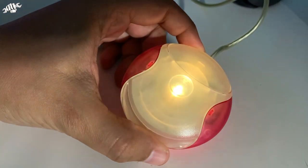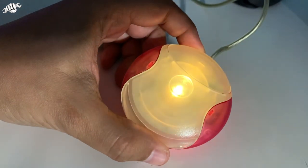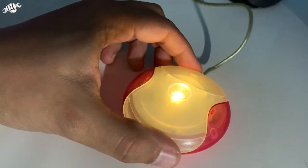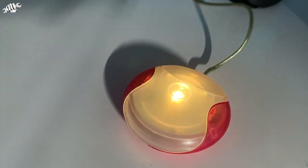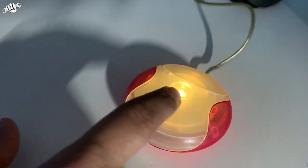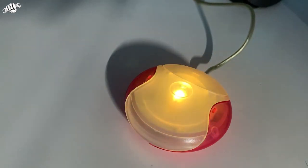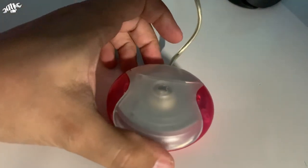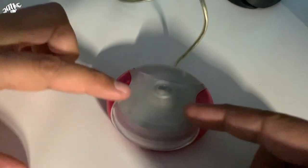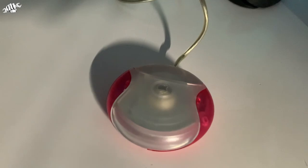This is very trippy. Oh, there we go. Yeah. Interesting. So I'll be taking this back out, trying a different LED. I can leave the wires in place, just solder a different LED on there and see what happens. But that's how it's done. If you want to experiment with this, you can also take two and a half volt LEDs, put one on each side, you know, just wire them in series. You probably have to mess around with some resistors to make it work, but you can expand on this idea